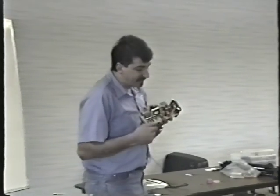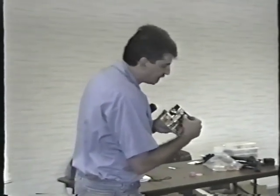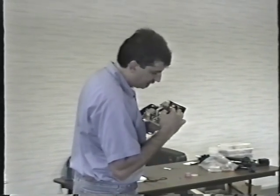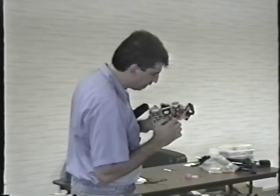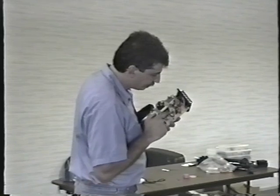That's the bottom line. Now, I think in this case, because of the discoloration of these capacitors, instead of being real bright orange, they're starting to get brown, maybe that is what caused the diode to fail. Oh, one of them's even busted in half. One of these minus 5 volt diodes is completely broken in half. That's interesting. Well, I must have just done it while I was testing it. The other one's shorted. How interesting. So obviously we'll have to change them both.